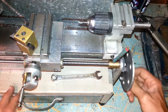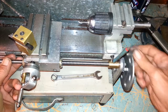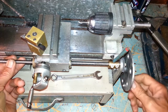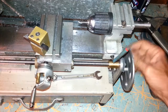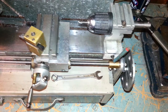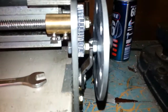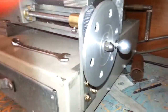The movement is not as harsh. If you've got it direct, it moves too fast. So that worked out. I had to actually make those little gears myself, couldn't find any. They're being filed all out of aluminium - 34 teeth and 18 teeth. It works a lot better, smooth. You can see down here, you fit your little nut. There you've got your actual nut coming around. There's the gearing - 34 and 18 teeth.